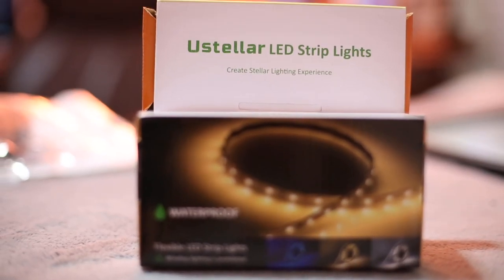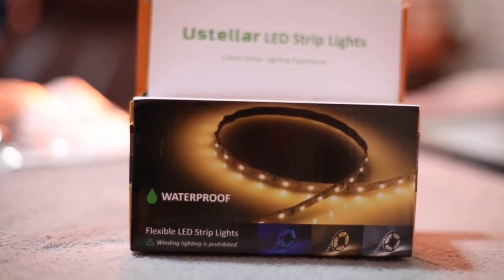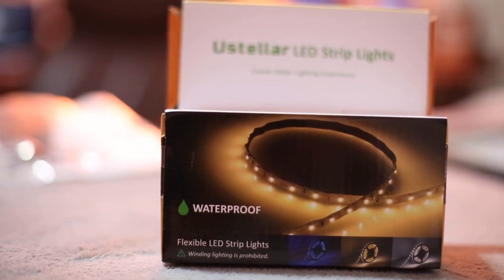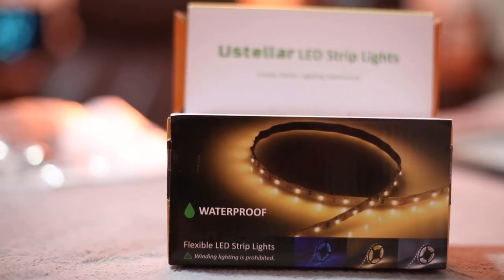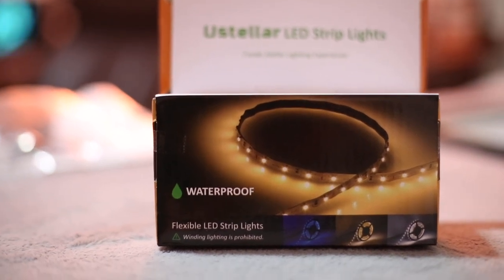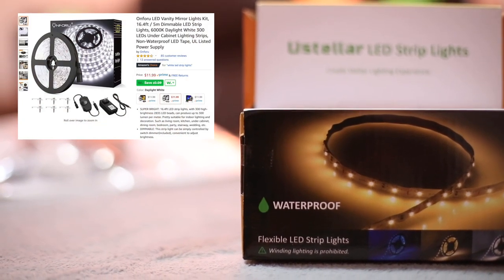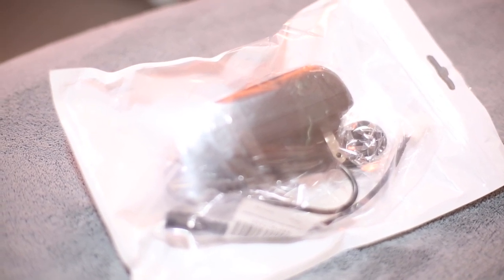The last thing you're going to need for this system I bought on Amazon — that's your LED strips. I made the mistake of buying the waterproof version. You don't need the waterproof version, although they will work. They'll be a lot thicker than regular LEDs. When you first buy this, it comes with enough to make about three mirror sets. The first one will come with a dimmable AC to DC adapter, so you won't need to buy that separately for the first one. If you end up making multiple, you'll have to get an additional AC to DC adapter.